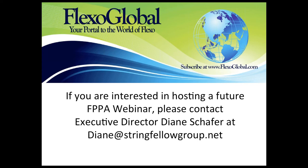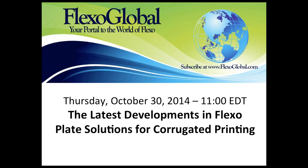In the 80-20 mix of alcohol and acetate, what type of acetate do you recommend? Standard general purpose acetate — and I can get the specific answer for that if you send me an email. What is the telltale sign on the press sheet that shows plates are underexposed? If a plate is underexposed, you're not going to hold your fine elements on the plate well. You should be able to see that right off the bat as you're making the plate, especially if you have a regular checkpoint throughout your process — you'll understand when those plates are not exposed completely. You won't be able to hold your fine lines, fine text, and small highlight dots.